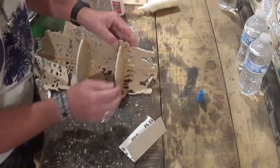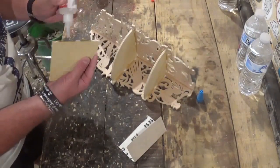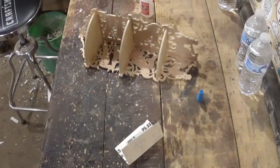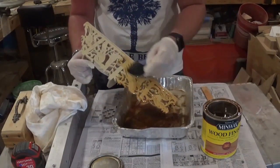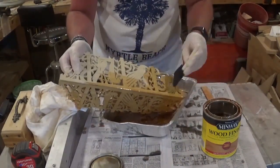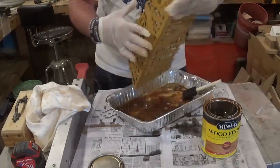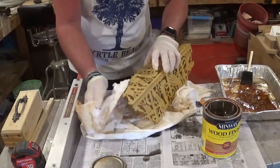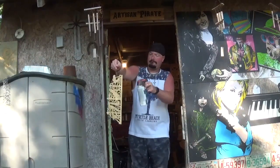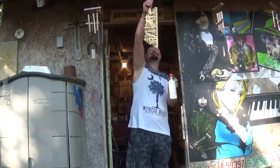I'm eyeballing and lining the shelves up as best I can. Once everything is glued up I'll let it dry again for around five minutes, then proceed to staining with Minwax wood stain. I use a sponge brush to saturate everything and get down into all the nooks and crannies, then wipe off all the excess with a piece of t-shirt material. Once it dries for around an hour it's time for clear coating — I gave it several coats of Rust-Oleum clear gloss and let it dry in the breeze, and the project was complete.